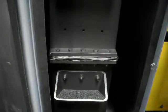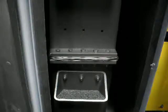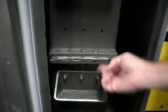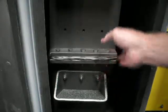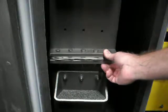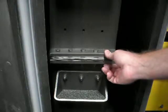It's really important when you string the elevator bucket belt over the top drum pulley. When you join the two pieces together, the top piece comes down and comes out this way, and the bottom piece comes up and comes out this way, and the splice is like this. Do not splice it to the inside, make sure it's spliced to the outside. Then you'll want to manually bump the starter without any shot in the system so that you can get it to track after you tension the belt.